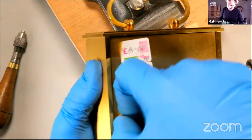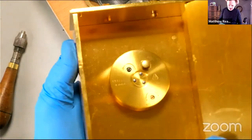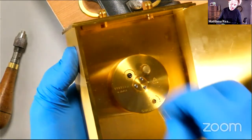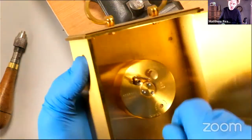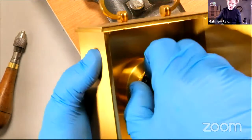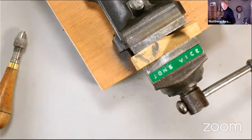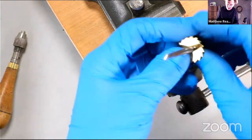And open it. So it's one of those little Swiss, nice quality, jeweled lever movements. Somebody started to take it apart, but the winding ratchet is broken. There's no click. Whether they've taken parts out of it, I don't know, but we'll find out. So that's going to be one of my repair things. But anyway, got this clock to finish and many other things and a bike to finish.